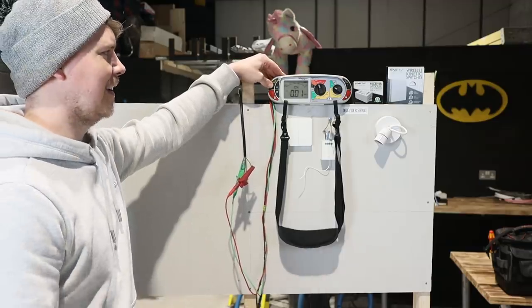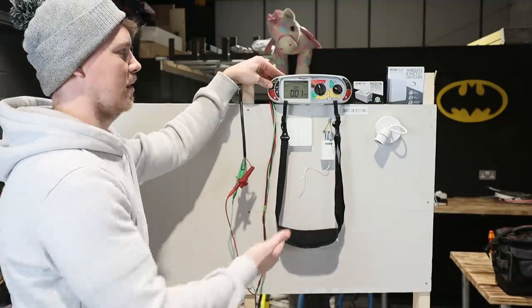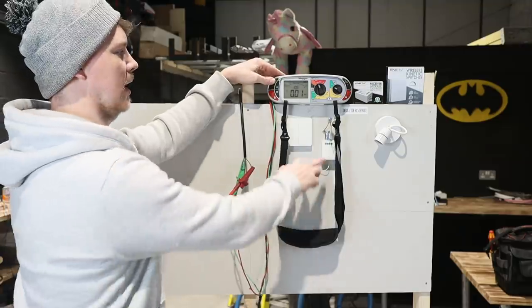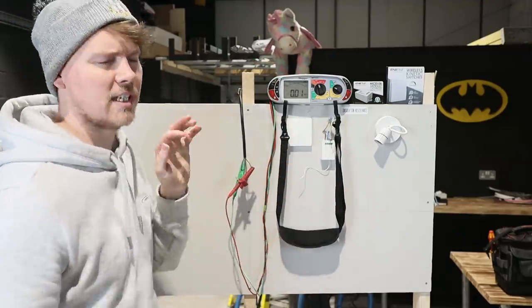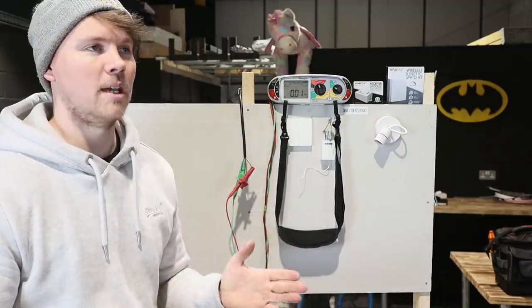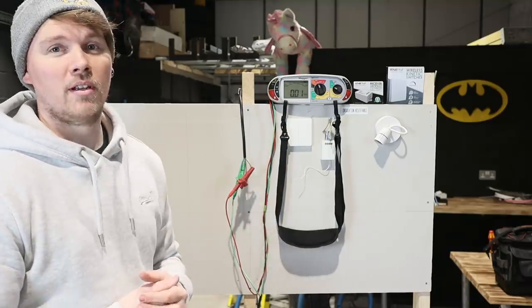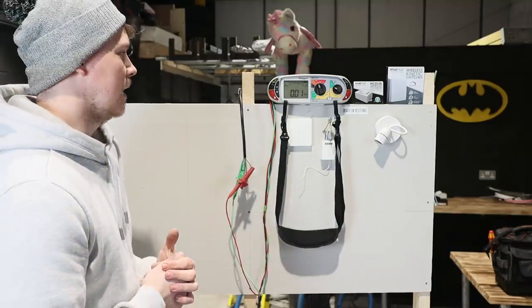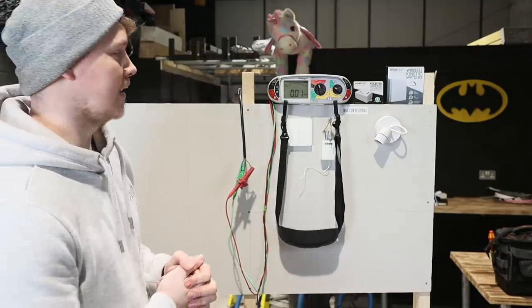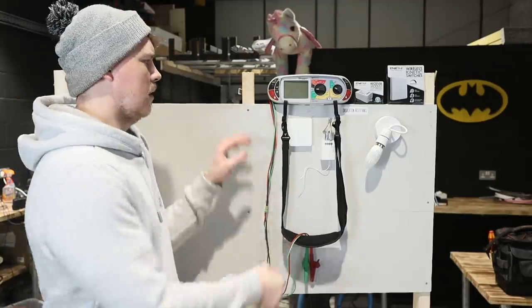Live to neutral — see down there — it's saying it's connected because of the smart switch. All the electronic devices, resistors and capacitors or whatever's in it — it's reading as a dead short, 0.01 megaohms. That's effectively a dead short. I'll wire it back in, give it a test, then switch it back over, put the bulb back in, and we'll try 500 volts.